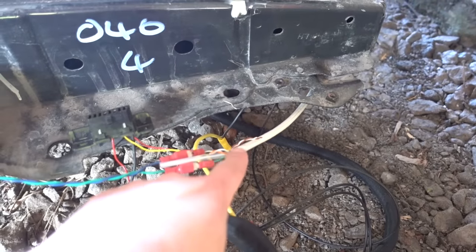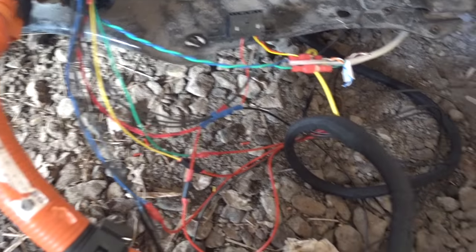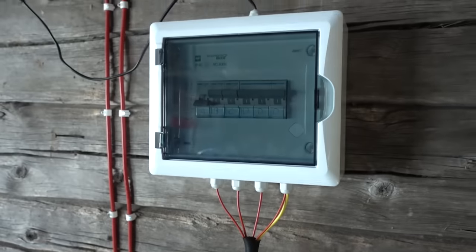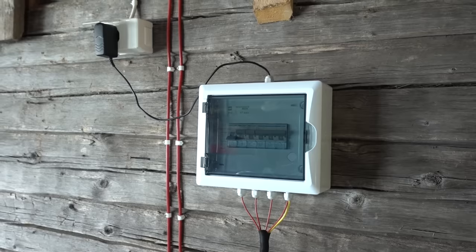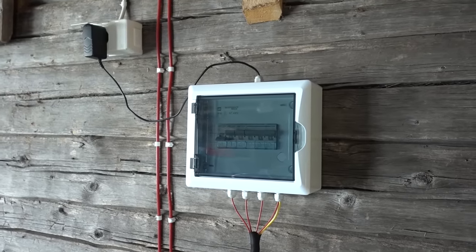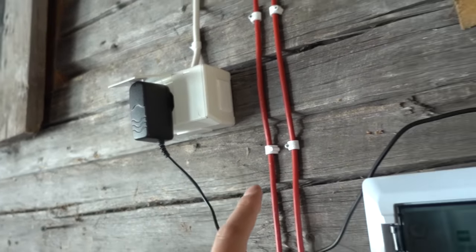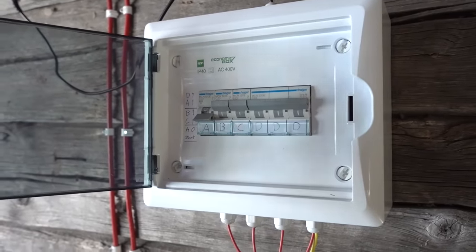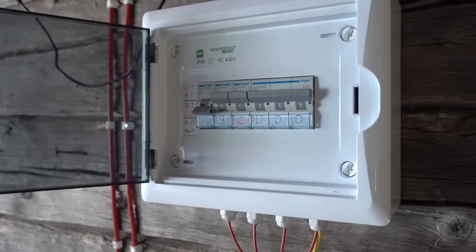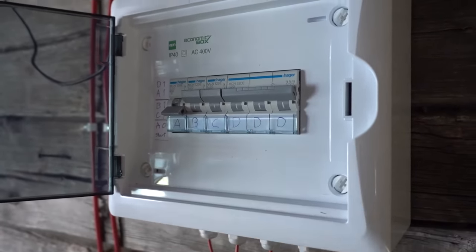Here is the CAN communication line that goes to the conversion box bridge. And also these other cables go into this wiring harness that goes all the way up here. This panel just distributes 12 volt to the battery. It has this 230 volt to 12 volt adapter, taken into this box where I have made some switches. These are fuses, but I'm only using them as switches so I can individually turn on pre-charge, negative contactor, positive contactor, and the BMS itself inside the battery.